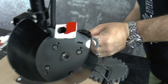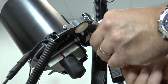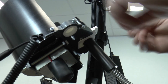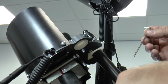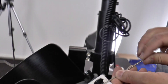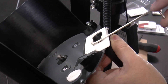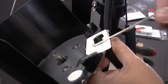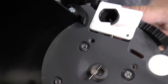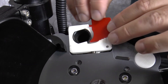There is a screw at the bottom that you can loosen in order to free the nose guide and allow it to move. So once that's loose, you can slide the nose guide in and out. And as mentioned before, you can remove the spacers and then have access to the screw on the top, and accessing that screw will allow you to use it as an adjustment tool to make minute position changes to get just the right position of your nose guide in and out. Once you have that where you want it, tighten the screw from the bottom and then insert the spacers back into place.